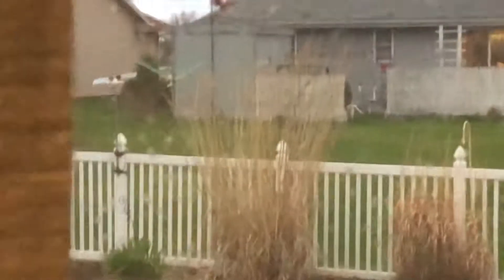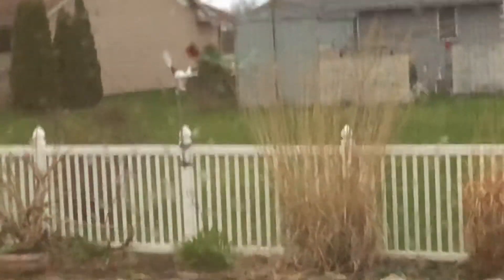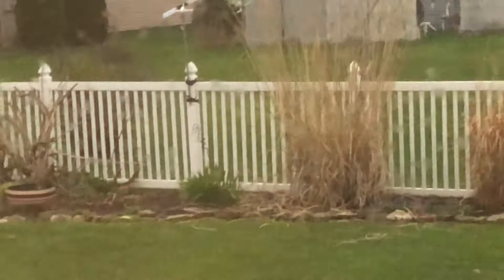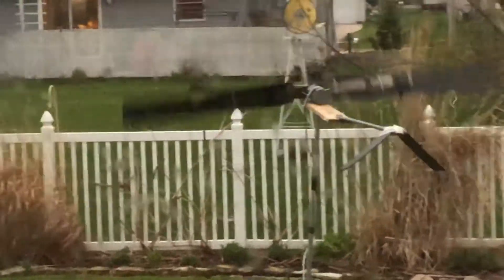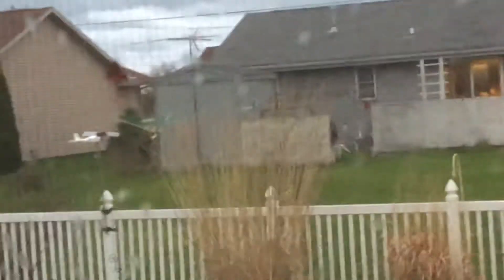The big one spins a lot easier, but in gust winds like this I'd prefer the little one because it's so easy to maintain, and also since it's a smaller blade it can spin faster. And it doesn't need to spin faster for it to even give off good voltage anyway. This one will give me a consistent 2 volts at 150 milliamps, which isn't great, but it's better than nothing. But that little one is just zooming today — it just loves to spin in this kind of wind.